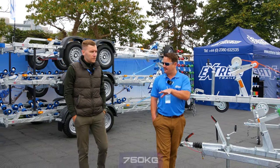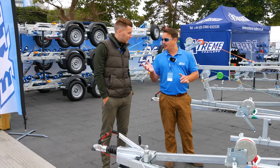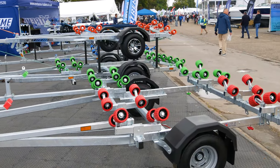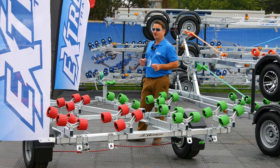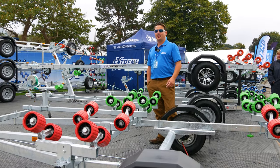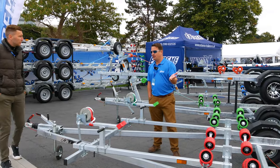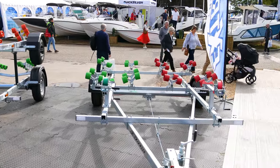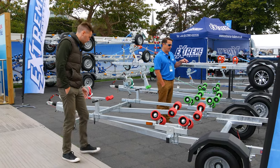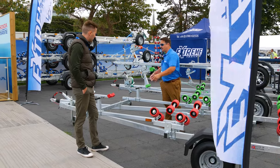We also offer a 750 kilo double jet ski trailer, suitable really for the Sparks or your lighter weight skis. This is our Xtreme 1300 kilo double jet ski roller trailer. Our customer has requested red and green — port and starboard — for nautical purposes. These are our non-marking wobble rollers, which come with a complete choice of roller colour. They're coned in the middle for free running. Suitable for any real jet ski, three-seater down to two-seater. They have a standard 16 rollers on each side, which are fully adjustable, same with the winch post.